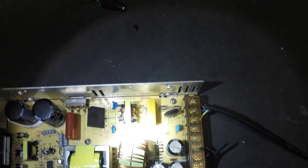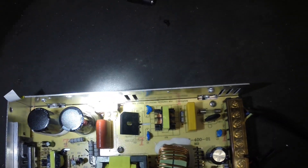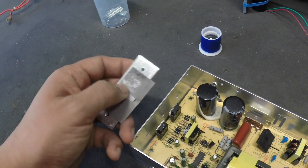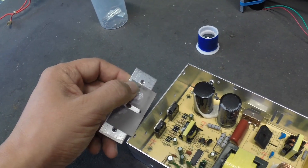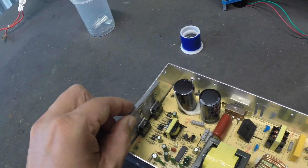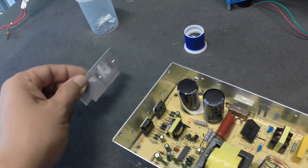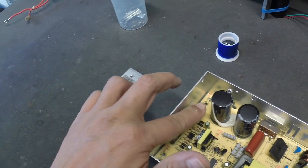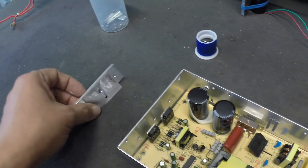After opening the power supply, it was clear that the fuse was still intact. A quick inspection pointed to one of the high voltage transistors. I also noticed the thermal paste between the transistor and the heat sink was no longer functional. After unsoldering the transistor, I found a tiny crack on it. Was the failure due to accumulation of charges or overheating? It is difficult to say — maybe both.